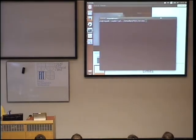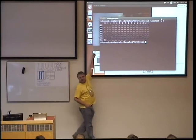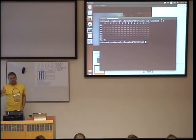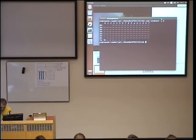So first, a very, very useful tool is, again, sudo i2cdetect. Now I must specify the number of the I2C bus. I'm using an old version of Raspberry Pi, so it's number 0. The new version is number 1. And here you can see a problem. I am missing one device. Never mind, we will solve it. The number 70 is the address of one device, and there is one missing, number 34. So give me a sec.